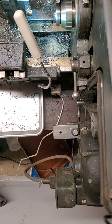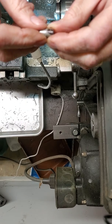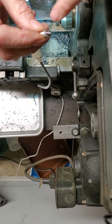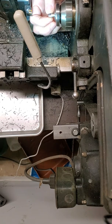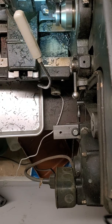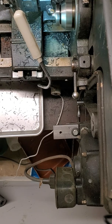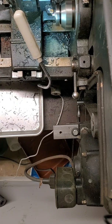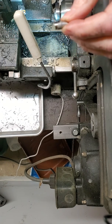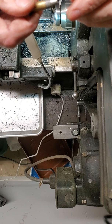I'm going to do the same thing now with one of the knurled bullets. On these bullets, because I don't have a grease groove to show me an endpoint, I've put some black Sharpie on it and measured about a hundred thousandths, then put a mark there so I know how far to cut. I'm going to put this in the lathe and snug it up. Just like that. Now you can see the heel is cut — slip it right into the case and it's ready to use.